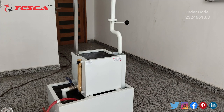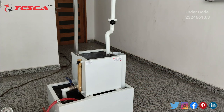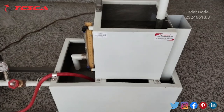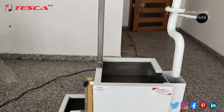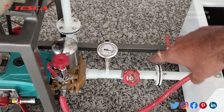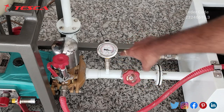Now we will fill the measuring tank for five seconds. Here you can see the water getting filled in the measuring tank, and you can take the reading from the level indicator. After five to ten seconds, once you have taken the reading, you have to keep the flow pipe back to its position where the water goes directly inside the sump tank. From here you can take the vacuum reading of the suction line — here we are getting the vacuum reading. You can control it by using this control valve.